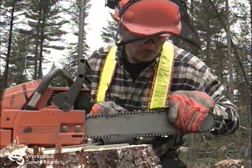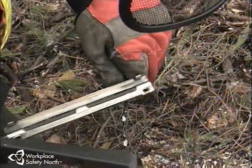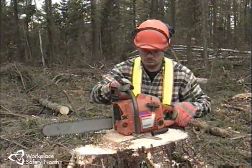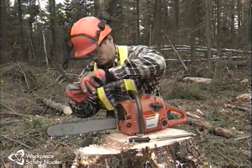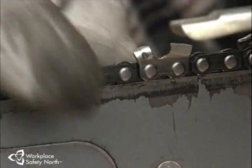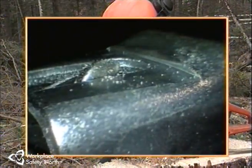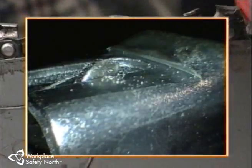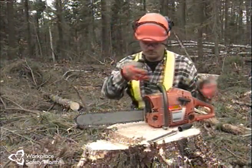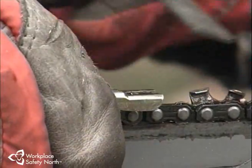When should the chain be sharpened? The answer is: often. A full and thorough sharpening, including a careful inspection for nicks, chain damage, or uneven wear, should be performed once every working day. Next, check the depth gauges and lower if needed, performing the work at the same point on the bar to ensure uniformity of all cutters. Depth gauges should be checked every day and lowered when needed, using the flat file and a depth gauge tool. File off any part of the depth gauge that protrudes, but be careful not to file into the gauge tool itself — never use a tool that shows filing damage. File all depth gauges on the side of the chain in an outward direction, then turn the saw or walk around to the other side, to ensure depth gauges on both sides are filed the same.